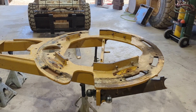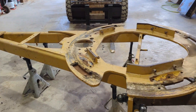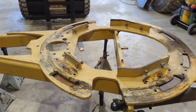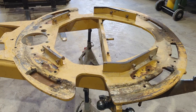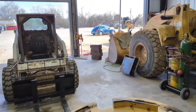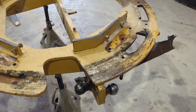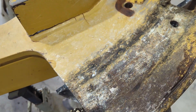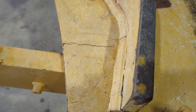This is out of a CAT 120 motor grader — not really sure what you call this, either a trunnion assembly or A-frame assembly. This is the bottom side where the circle sits or hangs from. It's all parked out there and it's got some issues — we've got some pretty bad cracking going on through this plate. A lot of years of hard work, I guess overstressed.